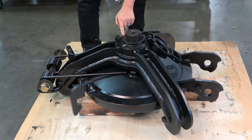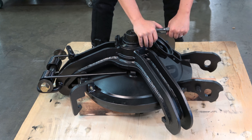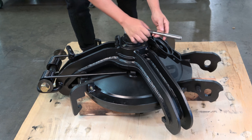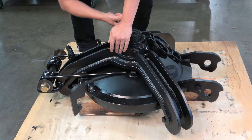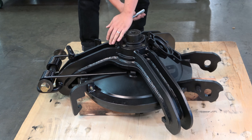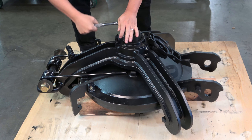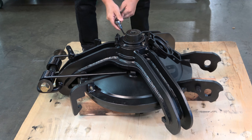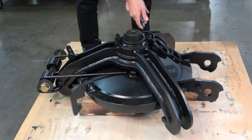The next step is to remove the cap assembly from the cover assembly. There are four hex drive flat head screws holding the cap in place that accept the 3/16 inch hex driver socket or Allen wrench. These screws have been installed with Loctite, so carefully break the Loctite hold on all screws before removing them. Using an impact wrench is not recommended with this type of screw to prevent damaging the hex key of the screw. Remove all screws and lift off the cap assembly, then set the cap and screws aside.